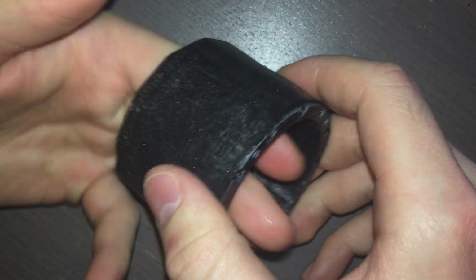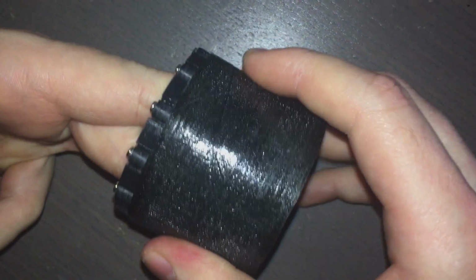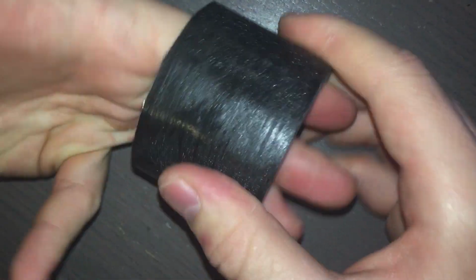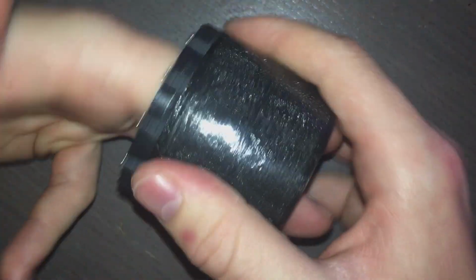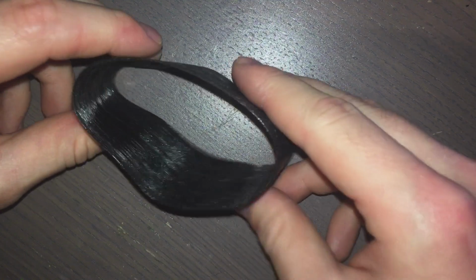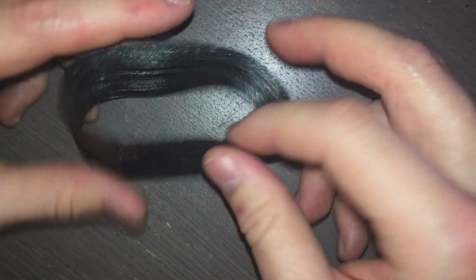Alright, so here we have the belt mounted on these rollers, and this belt is a little bit thinner than I expected, but you can see it's fitted on those rollers there, and the rollers do a good job of reducing friction, I feel. No matter how hard I'm pressing to turn this, it takes about the same amount of torque to rotate it, but the belt I think is too thin, so it doesn't really have any structural strength. If I take it off here, you can see making it 0.5 millimeter doesn't seem like the right way to go. I could go for 1 millimeter or even 1.5. I want it to be flexible, obviously, but not this much.